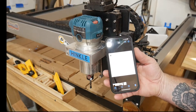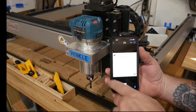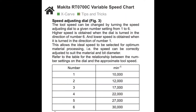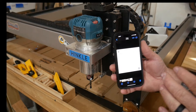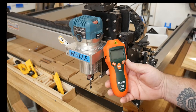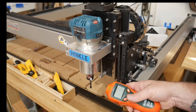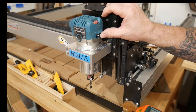Makita. I looked up a speed chart for these numbers on the dial. It goes 1 to 6 — starting at 10,000 RPM up to number 6 at 30,000 RPMs. So we're going to put this on number 4, which is where I typically would run the Makita router. I put a little dot of white paint there. We're going to turn the router on — here's the tachometer to measure and confirm. I'm hoping I can angle this in the camera so you can see the number. Let's go ahead and start it and put the tach on it to see what we get.